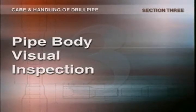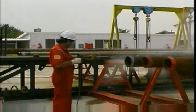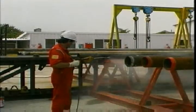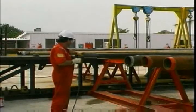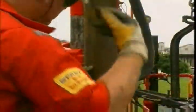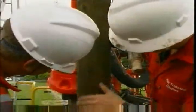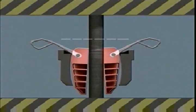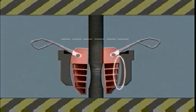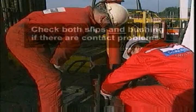So far we've covered the inspection of tool joints, but we haven't said much about inspecting the pipe body. Remember, more failures occur in the slip area than in any other part of the pipe. First, clean off dry dirt and corrosive materials and rinse the pipe body with fresh water. Examine the slip area closely — watch out for flat places with deep die cuts, as this type of damage usually leads to serious downhole problems and is often the result of worn rotary bushings. As the bushing wears, the slips settle lower and lower, and the bottom part begins to wear more rapidly, giving less lower slip support. This throws extra strain on the upper slip region and tends to crush and damage the pipe. You should monitor bushing wear all the time to stop this happening. If damage has occurred, mark it with red paint and replace the bushing right away.